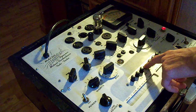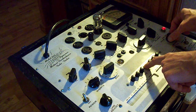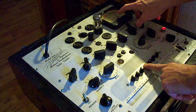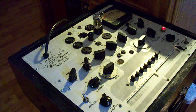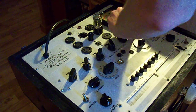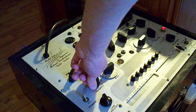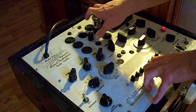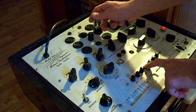No shorts. Now pressing P4. I had a dirty tube socket — there we go. So we're reading a little bit above 2,000. Bringing it down to the 3,000 scale, we're reading about 2,200. The spec says we should read 2,600, so this tube is actually checking a little bit weak. Now checking the other side: selectors at 2, 1, 0, 3 with a 5. Same settings all around. No shorts — this is triode number 2.